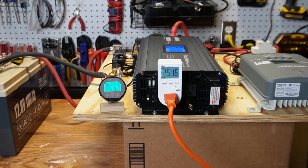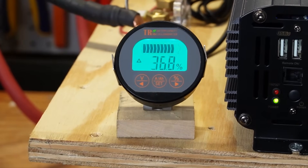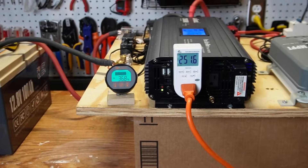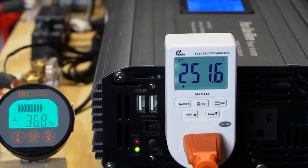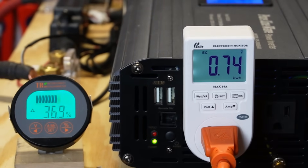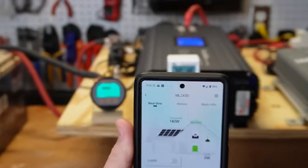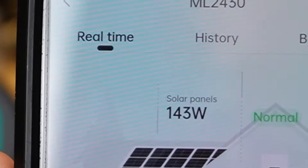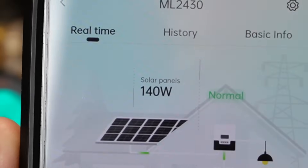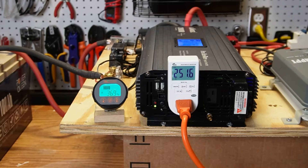Day one is complete. It's the next morning. The battery held up overnight — it was around 35% when I got up. The battery is currently charging; the sun is out and hitting the panel well. We've used 0.74 kilowatt hours so far. The mobile app shows the solar charge controller and the panel is bringing in 143 watts at the moment. I have my doubts that the panel is going to be able to produce enough power to charge up the battery before we have to start drawing on it again overnight.